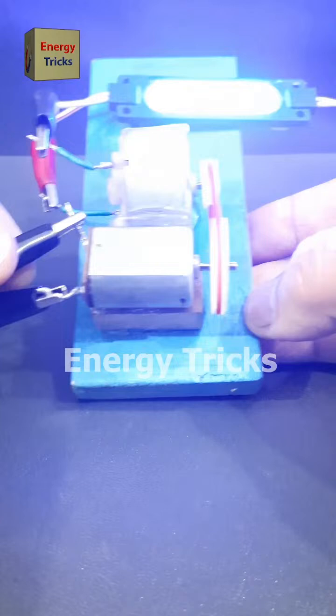This is a DC gear motor. When I connect it to a battery, it rotates in the clockwise direction. If I swap the positive and negative terminals, it rotates counterclockwise — this happens because a DC motor's rotation depends on the polarity of the power supply. However, in some applications, we may need the motor to always rotate in the same direction, regardless of how the power connections are made. To achieve this, we can use a bridge rectifier. A bridge rectifier ensures that the polarity of the motor remains consistent, even if we change the input connections. Now I've connected a bridge rectifier to this motor — even when I swap the battery terminals, the motor continues to rotate in the same clockwise direction.